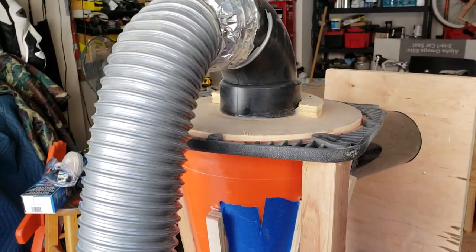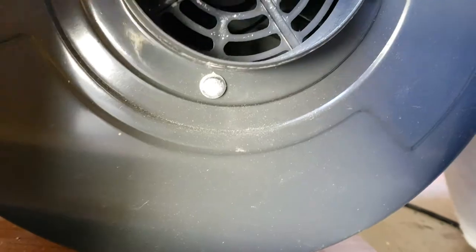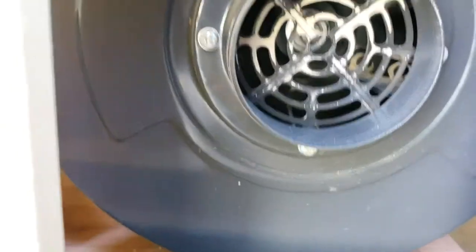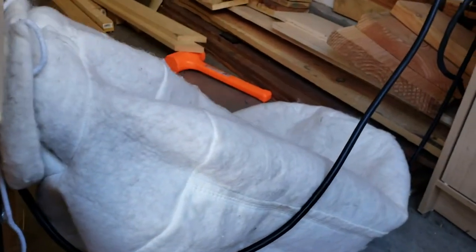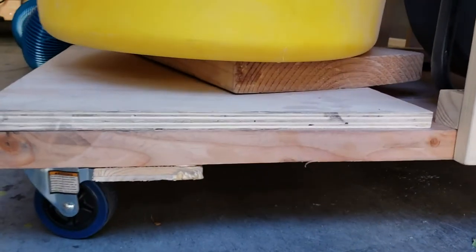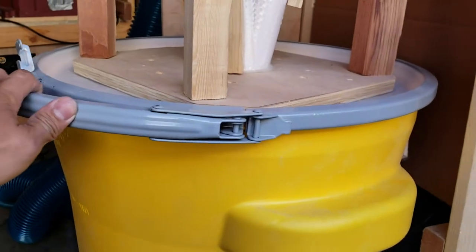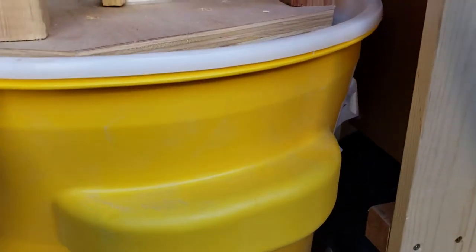The collector is pretty effective. The only stuff that makes it through is like a piece of paper or a really big flat wood chip. The dust that makes it to the collector bag is really really fine — maybe a couple microns. This bag I've hardly ever had to empty. Almost everything gets into the bucket. After a few months of use you can see there's quite a bit of dust in the bucket — this thing really works well.